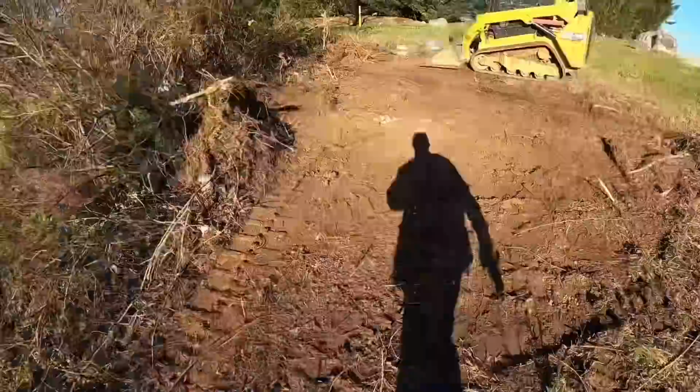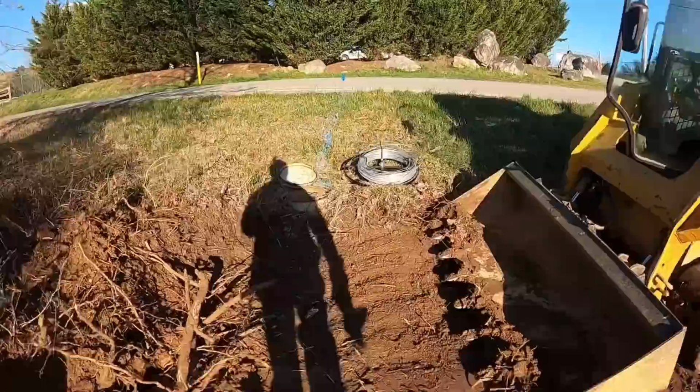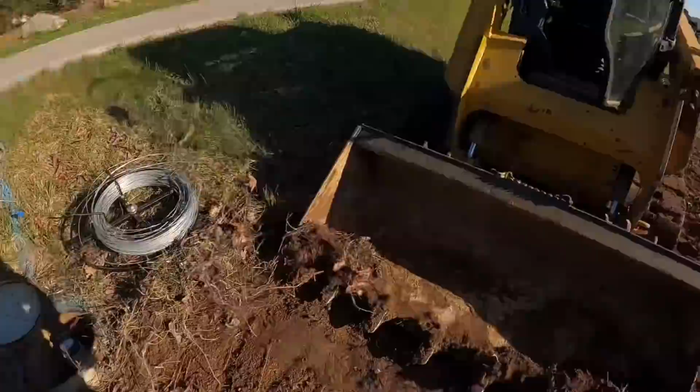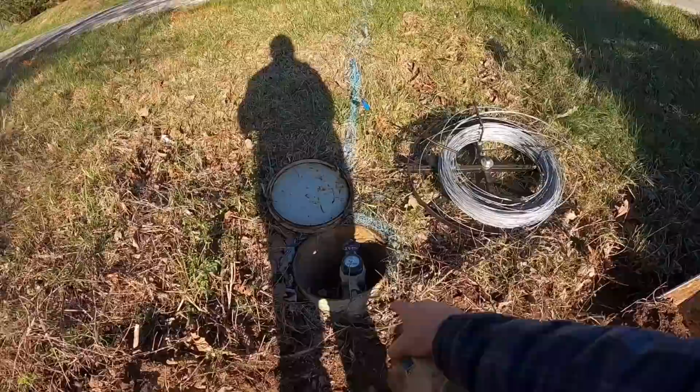And the next thing I want to do is get that dug out around that pipe coming out of that meter. Because I'm actually going to cut, I've been in it before, it actually comes out and curves and goes this way. Because there used to be a mobile home setting just to the right side of my truck on the other side of the power line. But it's an old copper line, and I'm going to dig that out and swing that back around. I'm actually going to cut that off and loosen that nut, take that nut and that pipe with me to make sure I get the right fitting for that.